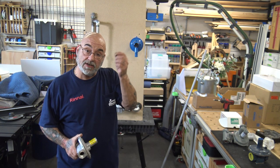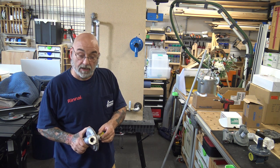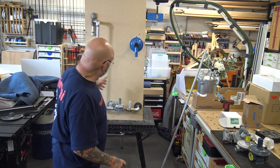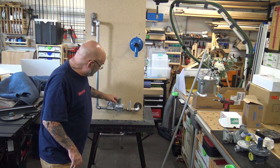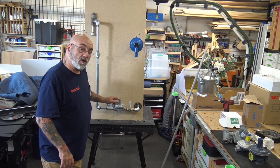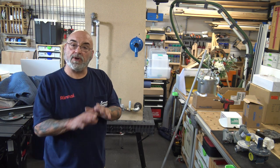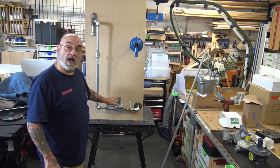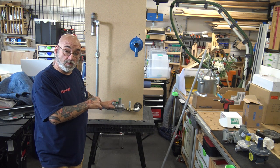It is inside. And if you shake it, you'll actually hear there's a little ball in there that will expel the gas, and then the ball, it's like a check. It'll shut down. So if this is going to simulate an outside regulator setup, you would put one of these rain heads on it. Now, when we buy these regulators, we buy them with the rain head or the weather head and a vent limiter. So we always have way extra pieces on the truck. Because again, if you put these inside with a vent limiter and you get an obstruction over the vent limiter, the regulator will not work correctly.